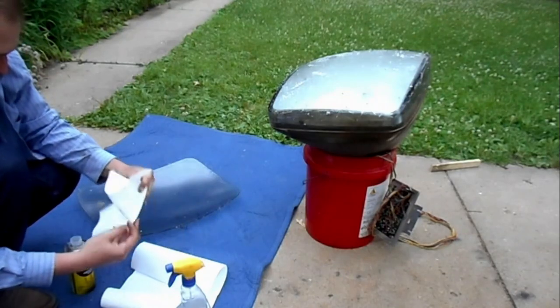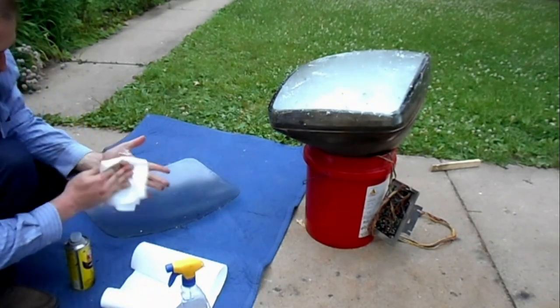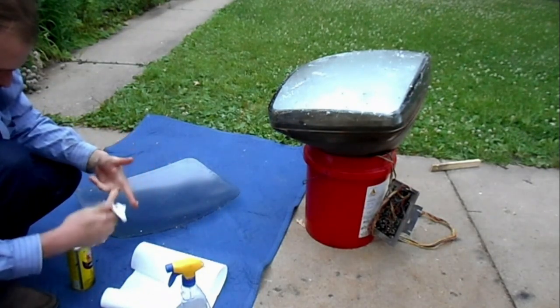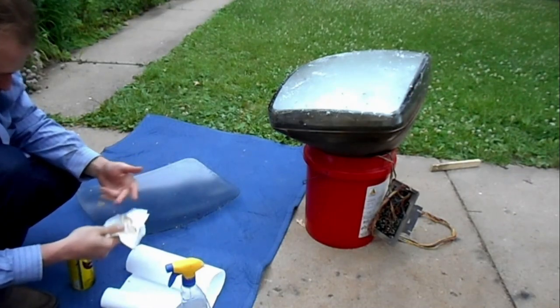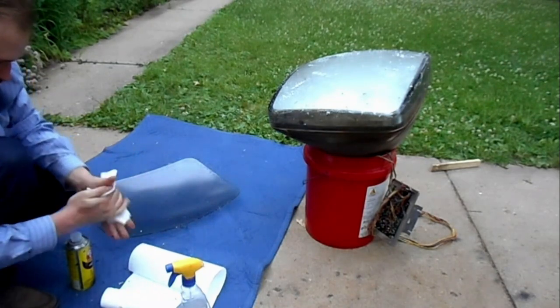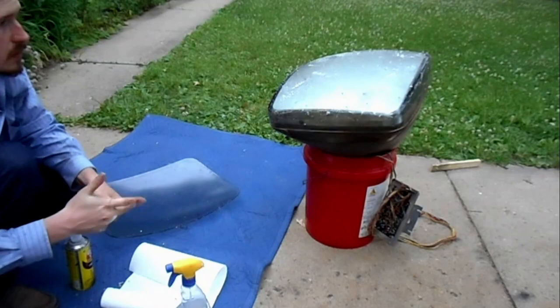And I didn't realize that the water, which was in the shade, was probably 60 to 70 degrees, and the face of the tube was 100-some degrees, and the tube face ended up cracking from the temperature differential it experienced.